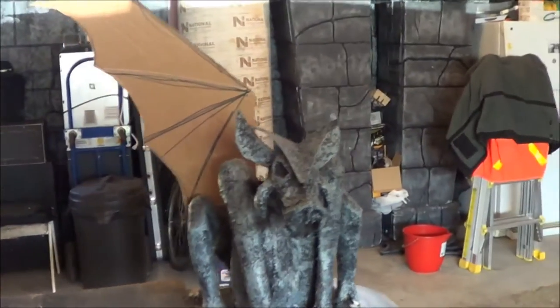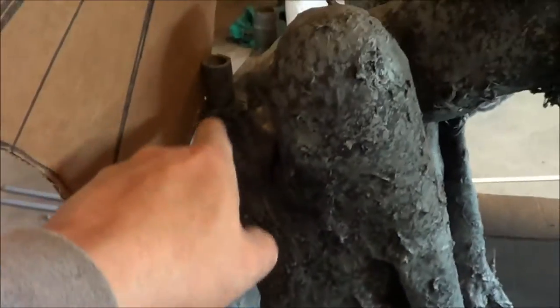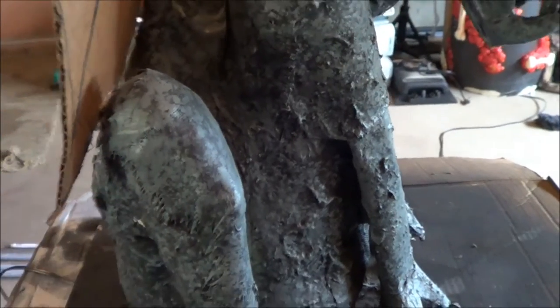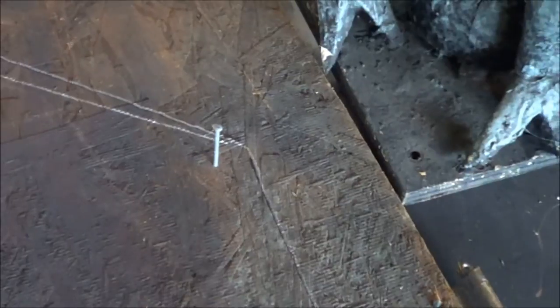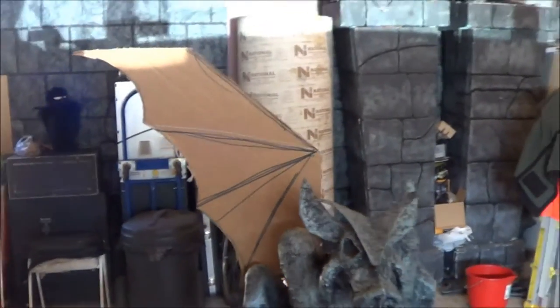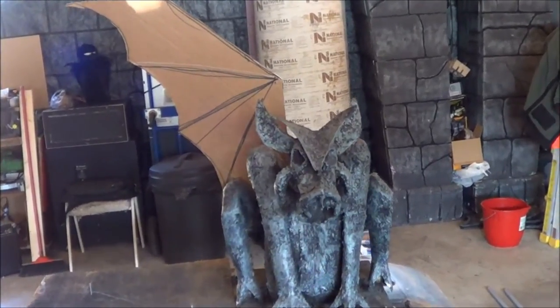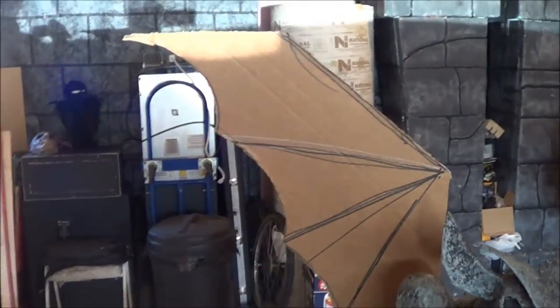We start with a template, in this case just cut out of cardboard, to help determine where cuts are going to need to be made. As you can see, this will run into the leg if mounted there, so I'm going to have to make some allowance for that — probably on both sides. Once the template is done we transfer it onto a board. I've got two lines: this is the original template line, but I think it's a little too narrow. I'd like to see the angle come off more like that.